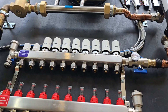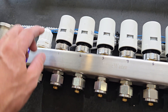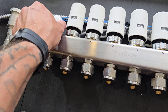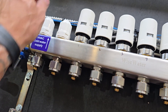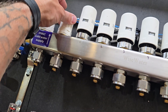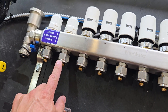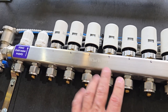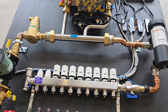If you've never seen actuators before, they're essentially a solenoid that replaces the on-off adjustment on the manifold — basically an on-off valve that controls each loop individually. If you unscrew it, that opens the loop; if you close it all the way, it shuts that individual loop off.